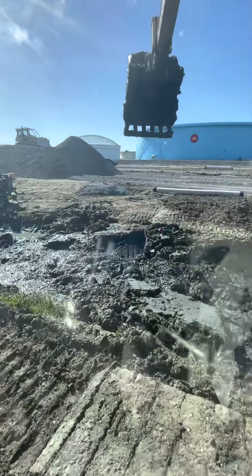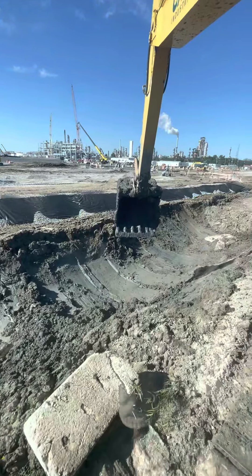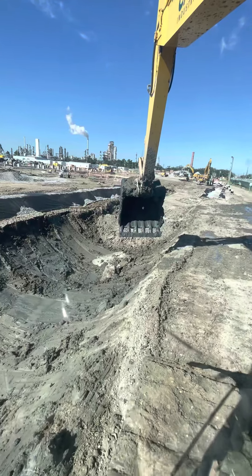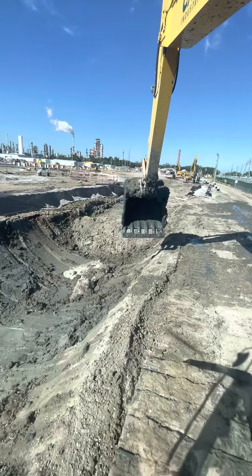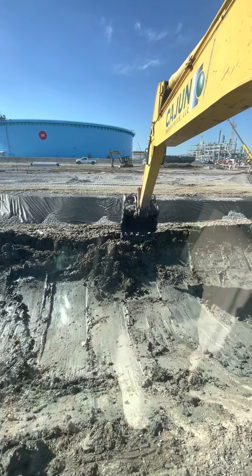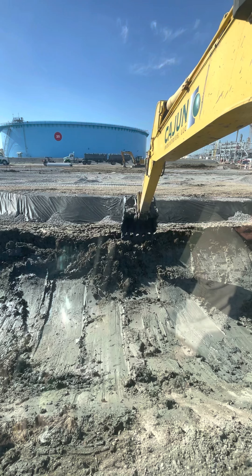Now we're back to business — I've got a little bit of cleanup to do. I stay ahead of everything, orient myself a little closer to the edge; I can reach over — not too close, keeping a solid 18 inches to the edge. This hole is not very deep, maybe four to five feet in some areas. The bottom elevation of the ditch varies based on how much muck there is — in some areas I only had to go down three feet because it got hard, but in other spots the water settled more and made it muckier and deeper, so you've got to get that out.